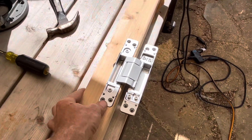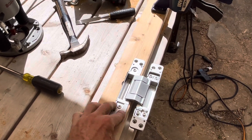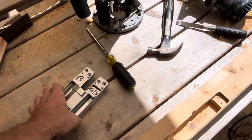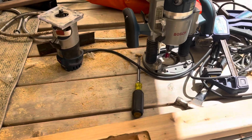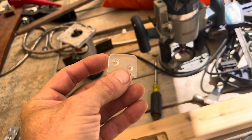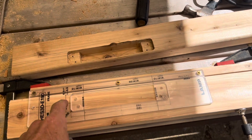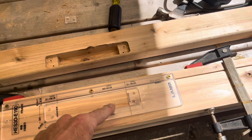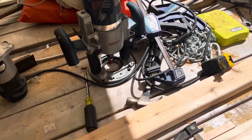Two hinges will hold 240 pounds or something — ain't no joke. Anyway, now it's done, but doing it backwards was really annoying. Another thing to remember: the hinge tabs are specific — this one's probably two millimeters narrower. This one is the frame side; see how the hinges will line up eventually. I'm going to sink some screws in here — that holds that in place, this holds this in place — and you just clamp down the wood so it doesn't skip around when you're using the giant router.